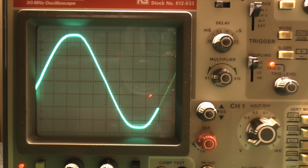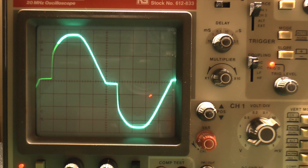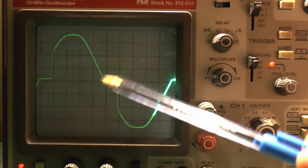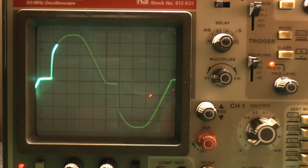I'm going to turn the dimmer to maximum and then switch in the dimmer — look what happens to the waveform. It goes from that fairly smooth-looking sine wave to this: with the dimmer in at maximum power, rather than starting up smoothly, there's actually a step here which is basically zero, followed by quite a sharp rise. We've still got the top of the curve, and it comes down to zero. There's the same thing in reverse on the negative side — a bit where there's basically no voltage, then it comes very steeply down onto the negative, and then goes back and repeats.